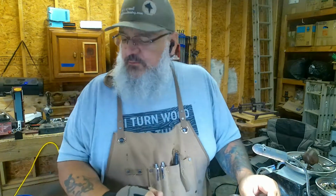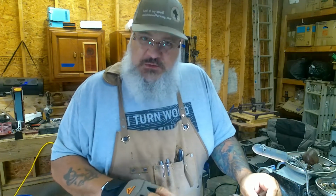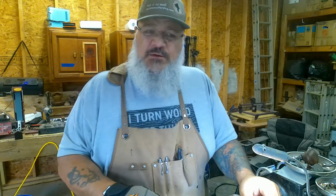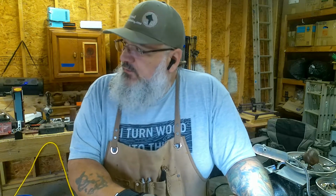However, I need to take a brief pause and talk to you about safety. One of the things I never do is wear gloves while I'm turning. I spent 15 years in the United States Navy, almost half of that shipboard, and a ship is an industrial environment, and they spend a lot of time working on safety training with us. One of the things that we learned, that was basically beat into our heads, for lack of a better term, is that rotating tools and gloves are a bad idea.